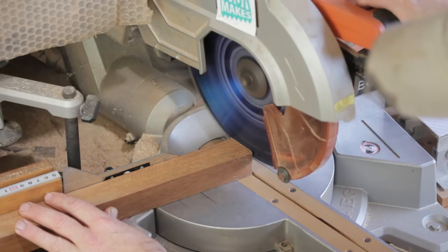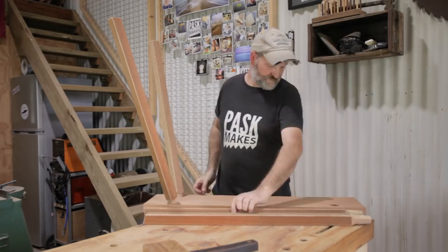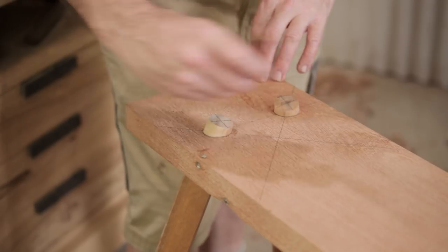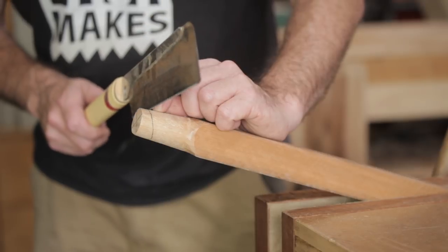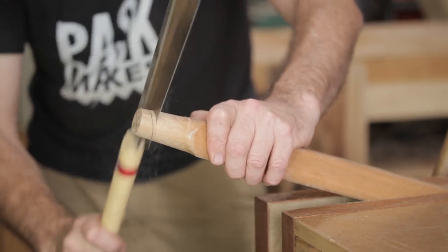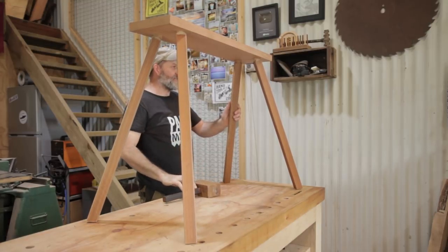I just took 15 degrees off the end of the leg and with a block plane I chamfered all the corners. This cut doesn't need to be accurate — we just need to come over around about a quarter of an inch so the end of the tenon sits below the surface of the sawhorse. It's a bit rickety and I've checked with the level — this side here is a bit too high so I need to take a little bit off this one leg.